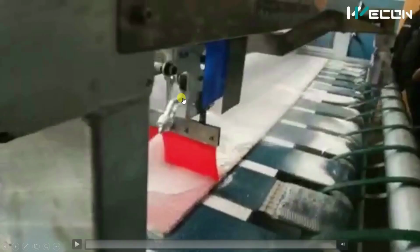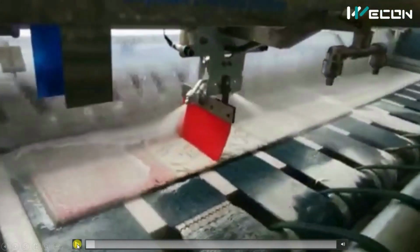After this, here also there are sensors. You can see this is a photoelectric sensor. When this wiper comes to this end, its rays are reflected from this blue plate back, and at that time it reverses its direction. Such an arrangement is also available on the next end, over here also. So let me show you. You can see it reflected, so it starts moving in this direction.